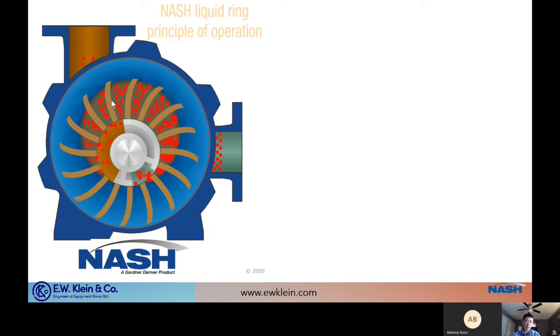We're seeing the rotor in action — the liquid ring has already formed and we've got the buckets there. The space between two blades is called a bucket. At the bottom of rotation, the bucket is filled with water, and as it rotates up, the water gets thrown away from the center of rotation. That separation is what creates the vacuum. Gas gets pulled in from the inlet into the space that's opened up. Then coming back to the bottom of rotation, the gas gets squeezed and compressed out by the bucket and the water — that's the discharge, a mix of gas and water.